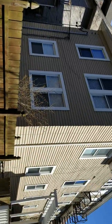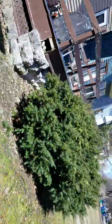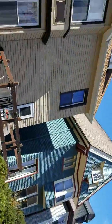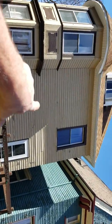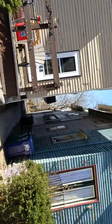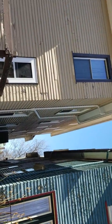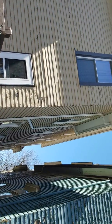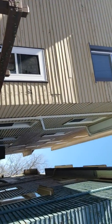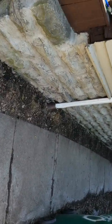Here's the front of the house — they've got a big round turret with no gutter. Even getting up here, we can ladder off; we need a 32-footer. I'll check if we can run our aluminum pump pole system and fasten it to the walls to get up there. It wouldn't be a bad idea to change a lot of his downspouts to 3x4 too, because he's got a lot of footage coming in and big drain tiles, so there wouldn't be any restriction.